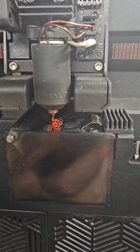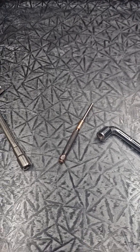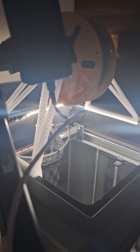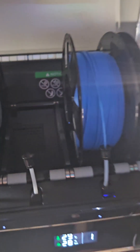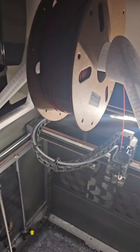So here's our first time using a 0.6 nozzle — the perfect excuse to try out a brand new 0.6 nozzle for the first time. We're doing 0.24 layer height, 5 walls, 0 infill. Another reason the spool is outside on a spool holder is because the cardboard roll it's on was flopping around in the CFS and it wasn't retracting or rewinding well. So we pulled it out and put it on the spool holder just to be safe.